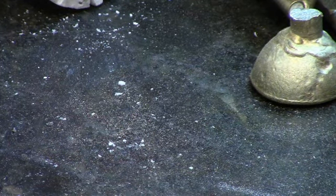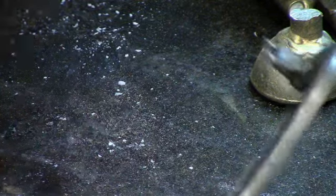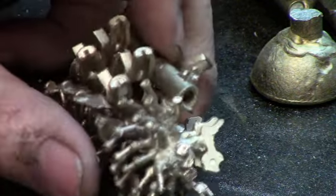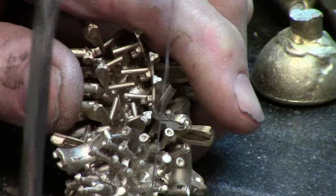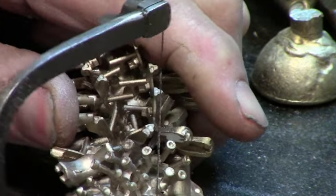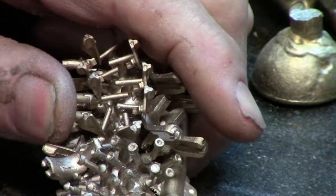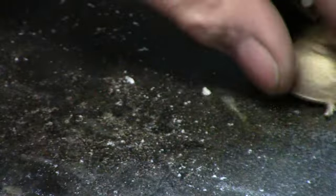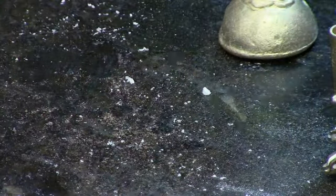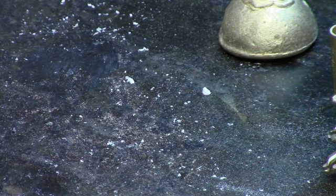Okay, if you've got a little room to get the cutoff wheel into the area that you want to cut off, that's fine, but on some of these, it's packed in pretty tight, and you don't have the room to manipulate and get it in without interfering with another one. The jeweler saw blade sometimes is your best. Oops. That one landed on my toe. Okay. With that, it's just kind of like eating an elephant. You do it one bite at a time until they're all off. And I wish there was a faster way, but that's my story, and I'm sticking to it.